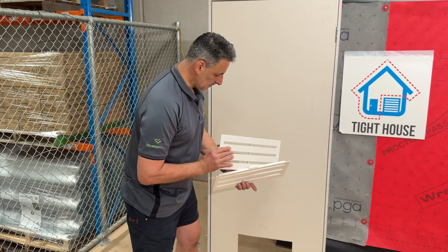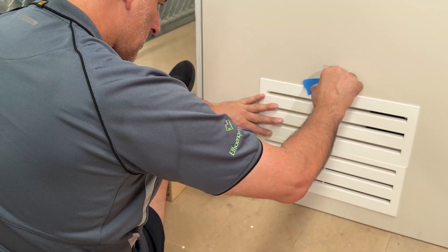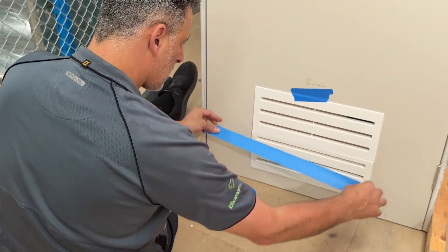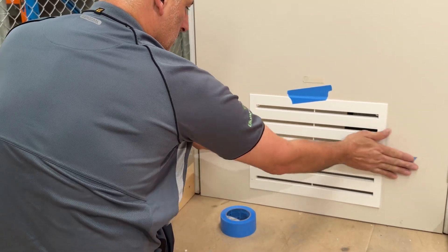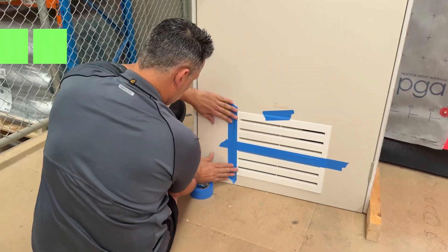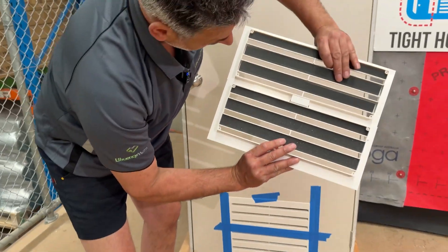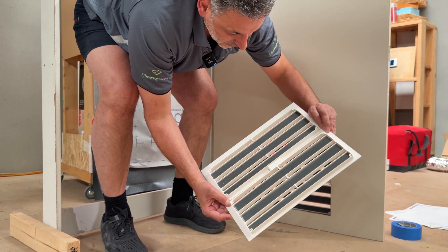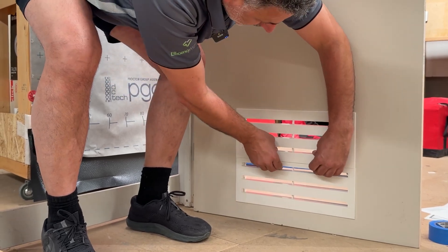They go like this. You're going to need some painter's tape. What we're basically trying to do is hold it in place so we can go to the other side and screw the other side in. So once that's in position, grab your other asymmetrical and standard Q-Vent — which, once again, goes like this. You can see the two black lines that allow for the block. Go to the other side, lining up the Q-Vent through the lines with the block, and put it in. Now, if you've put it in and you can see through, it's installed incorrectly — you need to reverse it, so it goes the opposite way.